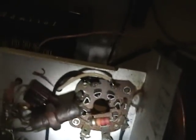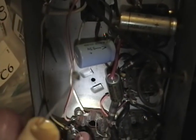Now when you've determined a component needs to be replaced, there are two methods I use — I've got my tools laid out here. One: you can cut out the old part, like this capacitor, and leave a little bit of the old lead hanging there. Then take the new component's lead and wrap it around a small pin to make a corkscrew out of it. You stick that corkscrew over the little lead that's still sticking out, and then solder it on. To hold it in place while soldering, just use a little pair of needle nose pliers and crimp it.